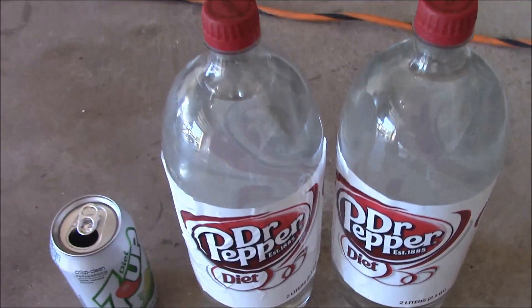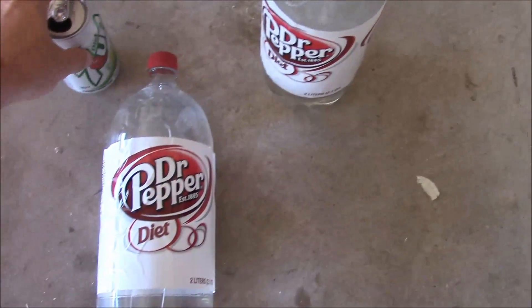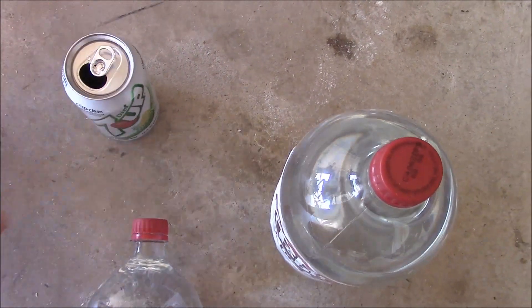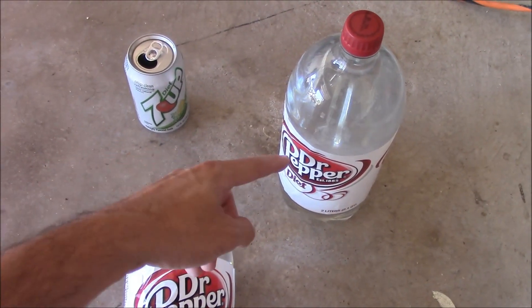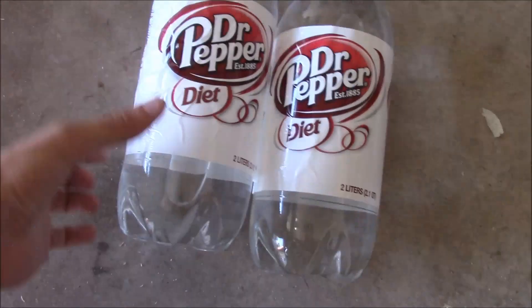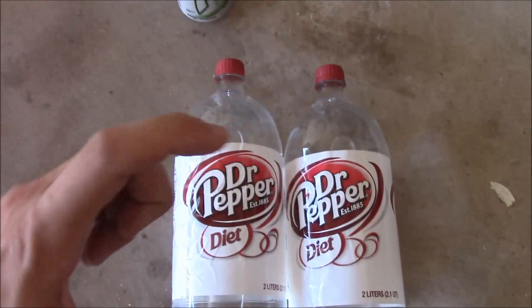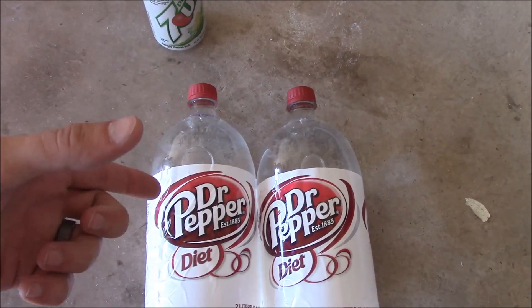The basic idea is I want enough room for a 2-liter bottle on the bottom, then a shelf, with enough space for some 12-ounce cans on top. We're looking at about 13 inches tall for the bottom section and about 6 more inches on top. Along the bottom it'll be about 10 inches wide. For the depth, about 5 inches for the interior plus 4 more inches in the back for the Peltier device's heat sink and fan — so about 9 inches deep total.